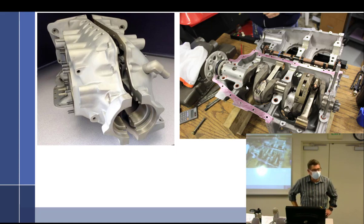So, there's that. And that's assuming this is a tractor type application. A tractor type means that the prop is in front of you like a regular airplane, and it pulls you through the air. If this was a pusher, in other words, the engine's in the back pushing you, then the thrust face is these little tiny slinger rings up here. So it doesn't, but yet you don't hear failures.